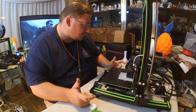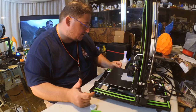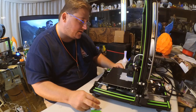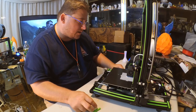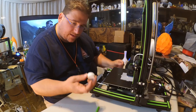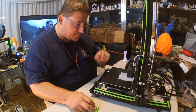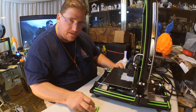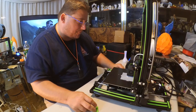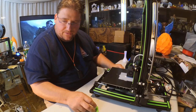It says it's good to go, and I haven't had any problems with the print head anymore. It seems to heat up fine now. Maybe that was just an initial thing. I haven't run any really good filament through it yet. This is just cheap filament and it's handling it like a charm. So once it's done this pyramid in the morning, I'll put some Esun PLA Pro in here and see how it handles that, which I don't anticipate being a problem. That PLA works wonderful and everything.